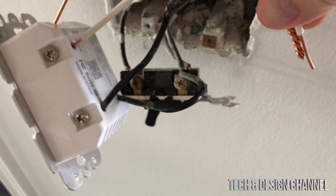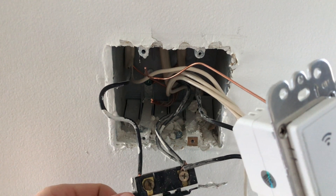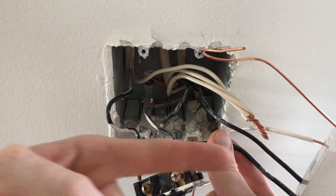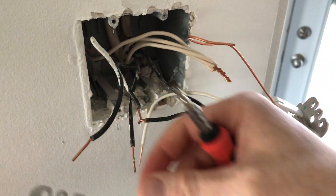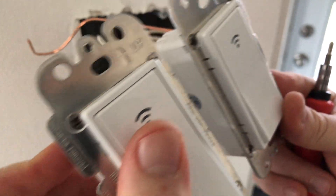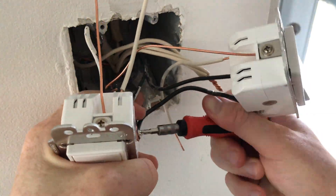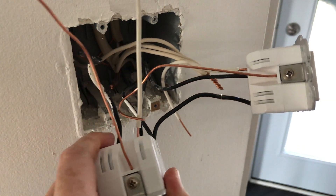The ground goes on the back. I'm going to move it aside for now and leave the white cable, and move on to the remaining wires. This one is on the side so it's easier — just a screwdriver. It looked like two cables but it's actually one that went through and then up to the other switch. We're doing the same connection on the new switch: load on one side, live on the other. Make sure you're putting the switch in the right orientation before tightening, then place the cables in on the side.